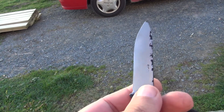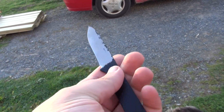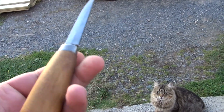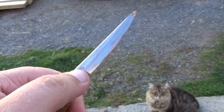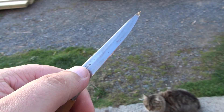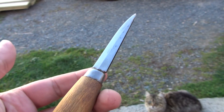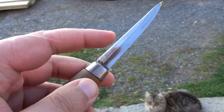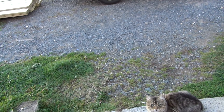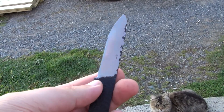So now I'll go in and rip all this steel off, and you'll end up with a very nice flat ground knife — a nice neck knife, a very nice little utility knife. And something that has always amused me, and I guess it's probably characterized as a bit of a pet peeve: I always get a kick out of when people refer to these as Scandinavian bevels, or Scandi bevels. They're just one single bevel — it's a very common bevel found on many, many different knives all over the place. And for me, someone referring to this as a Scandinavian bevel is like me referring to this flat ground part as a Canadian bevel. It's a very silly thing to do.